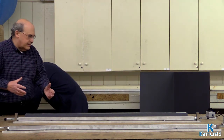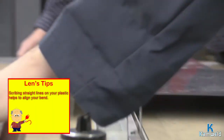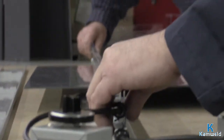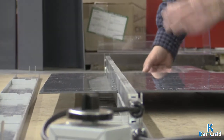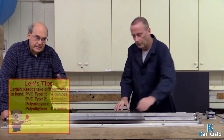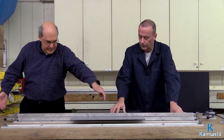What we did before is scribe the line, and try to put the line where we want to bend in the center of the bar as best we can. Same scenario — we are going to let it bend once it gets a little bit hot. Remember, as I said, there are different cycles for different plastics. This plastic might bend, at this thickness, after a minute.